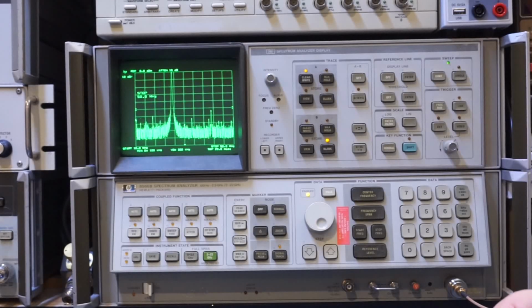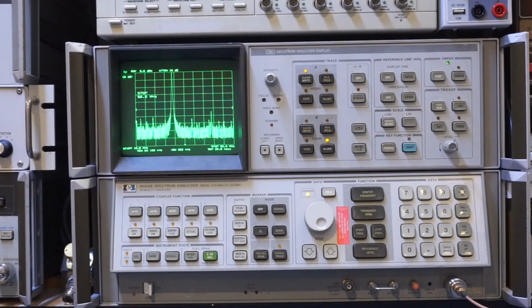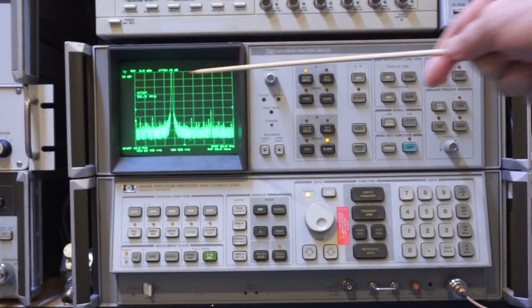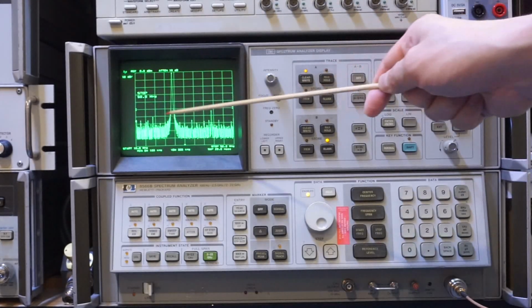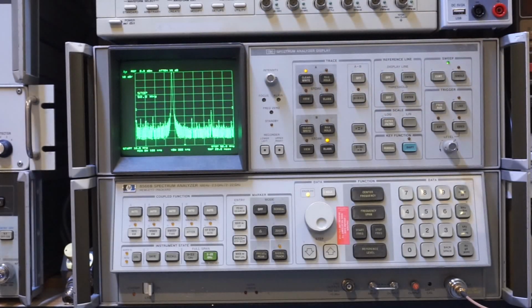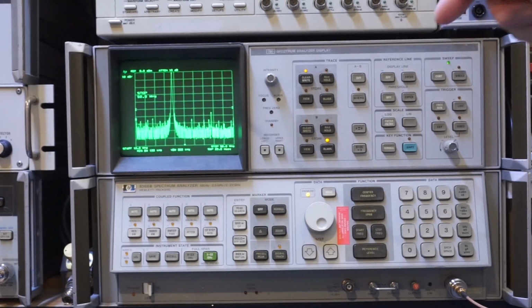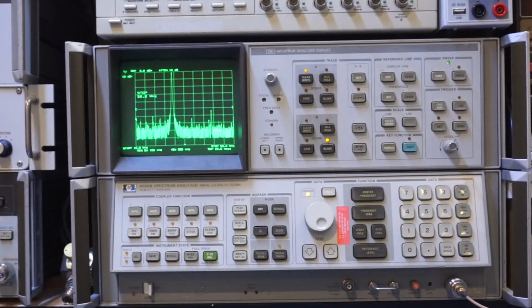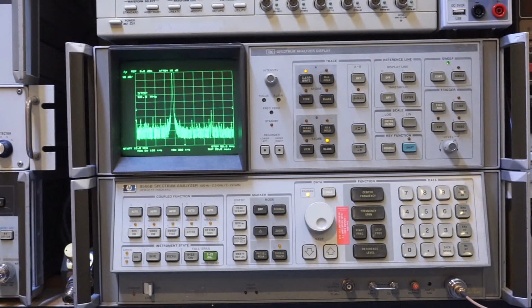Again, OWON is set up in pretty much the same way, outputting a 25 MHz signal. And right now you can see we do have more pronounced spurious signals here. So clearly those are just some of the artifacts from the synthesizer, but regardless, the signal outputs are pretty comparable. So that is from the signal sitting at 5 volts peak to peak output amplitude.